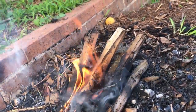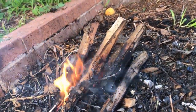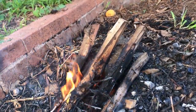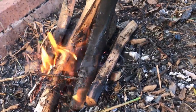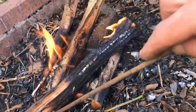That particular block is super super hard to work with, even compared to red, black, and gray granite. But fire it up for a very short time — you don't even need to go to an hour. If you burn for an hour it'll basically start falling apart in front of you, but you only need five to ten minutes, then bring in a stone tool.